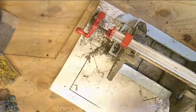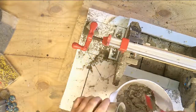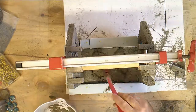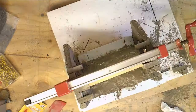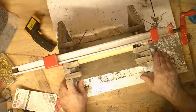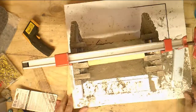Once again this turntable comes in really handy — imagine trying to work around this broken wall without one. I am putting the rocks inside where the windows were, trying to make it look like a solid wall — or where they remodeled and took out the windows. I am trying to pack in the hole and make sure the concrete goes all the way down in the crack. I use a temperature gauge to watch the concrete cure: at first it will heat up, then return to room temperature. Once that happens it is pretty much set up and you can start moving it around. I was a little apprehensive, but it looks like we succeeded.